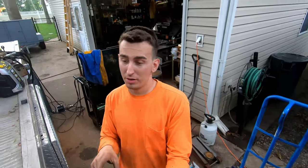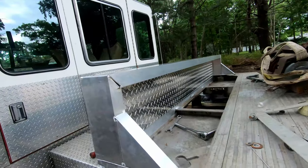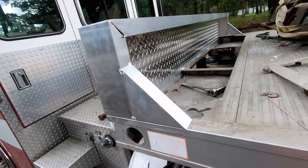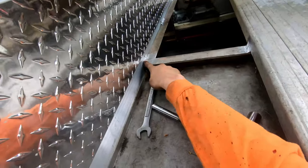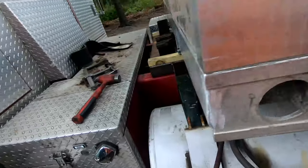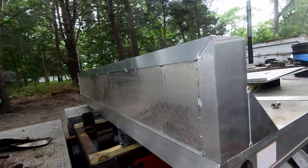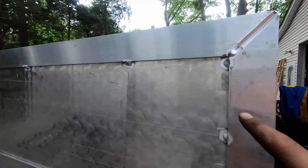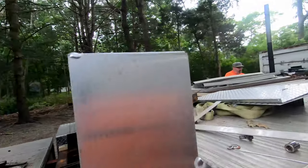This took a little bit longer than I thought. When I was going to weld in the front flat bar, I found a couple cracks in the bed, so I had to repair those. But this is what we got so far. I've got the diamond plate on this side so it kind of matches — it is a little shinier but it is what it is. I got the gussets in, it's nicely tacked together, I fixed those welds, and blended this side in nice. I'm doing two-inch stitches all the way through, and we'll have a nice headache rack.